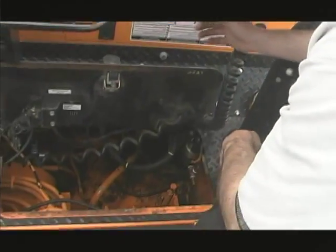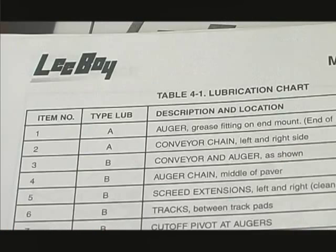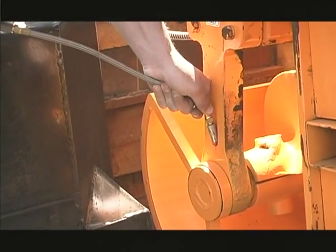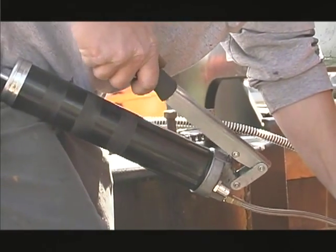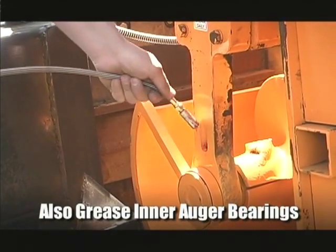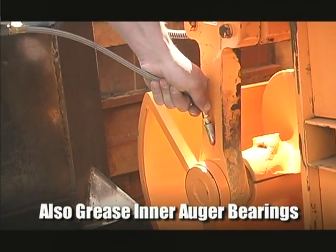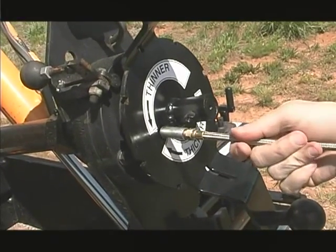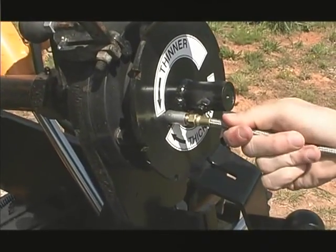Use extreme care when making any checks or adjustments with the unit running. Check the manual for locations of all the grease points on the paver. Grease points should be lubricated with a grease gun filled with an approved lubricant during periodic or hourly maintenance as described in the manual. Pay particular attention to the fittings that require daily greasing. These include the auger grease fitting on the end mount. Other fittings must be greased weekly, including the depth screw in both locked and unlocked positions, the main flight screws, ball socket and nut.